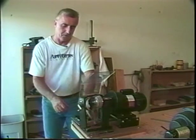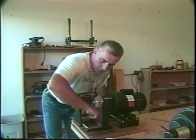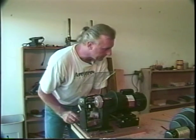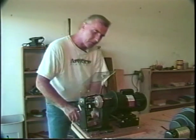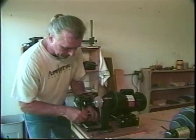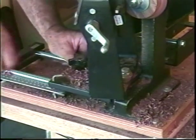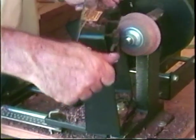This piece is just waste, so you loosen it up, lift up the index pin, and remove your waste piece. Now it's angled. Get rid of your extra wood chips again and get this piece up for your next cut. To get it really close, you loosen this top nut and take off this bottom plate — you'll be able to get in farther because that plate will hit, and it's not necessary for every single cut. Now you can get the guide index pin in there and make the cut for this size angled ring.